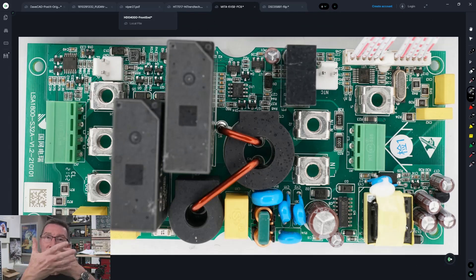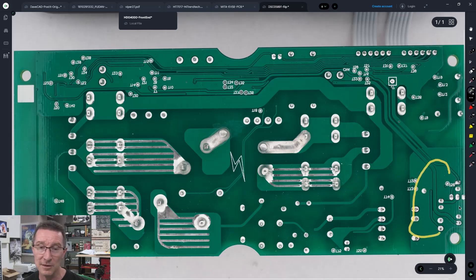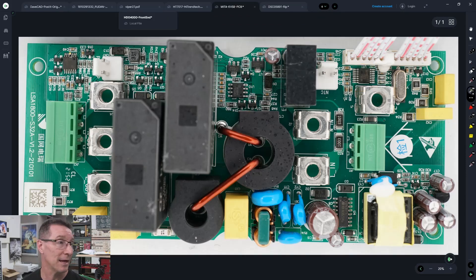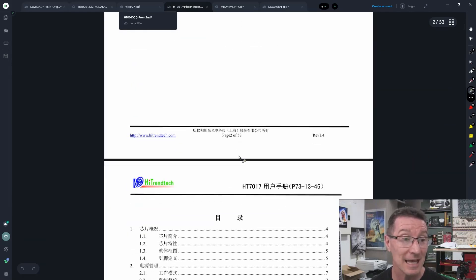I'll flip to the backside of the board — flipped and oriented so we can see the output. There's the secondary output there, and you can see that powers all the stuff along the top side. That includes this chip, this one, and this one here — this one is right near the PWM output, and it would control the relays as well. You can see a couple of back-EMF diodes in there. This one is obviously to do with the current sense, the core balance relay, and this one over here I thought was just a driver going to the LCD, like a shift register or something, but no — it's more interesting than that.